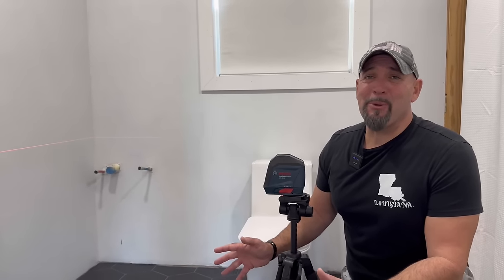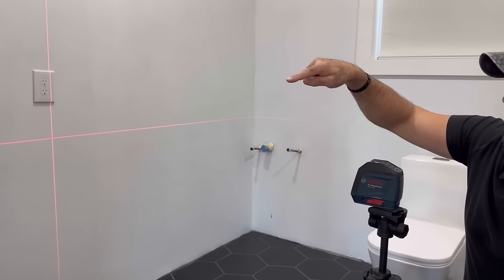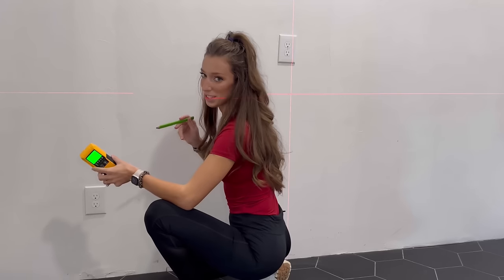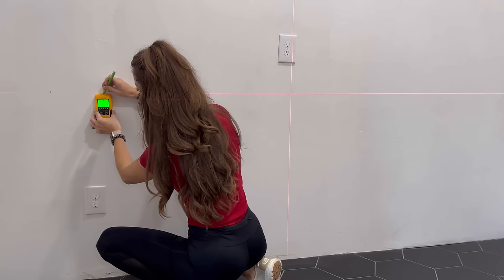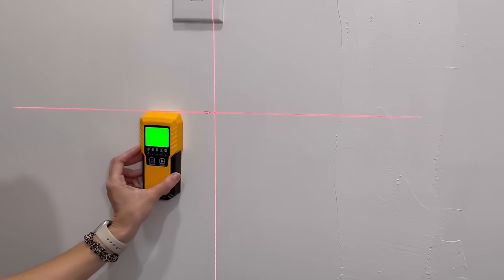Here's a really important question — how wide are we going to make the vanity? That is an excellent question and it's also a question I don't have an answer to. Just like everything else, I think we're just going to build this thing to site. We'll take the measurements as we go, see what's going to fit, and just build out from there. So what we're going to start out doing is land a two-by-four all the way across that wall, screw it into the studs to make sure it's nice and level, so we have a really bulletproof anchor point to mount this thing to the wall. While Jim's getting the saw set up, I'm going to go ahead and find all the studs so we can screw everything in and know exactly where we need to be putting this vanity. Even though it is just a vanity, we want to be able to sit on it with no weight problems, so we definitely need to be screwing this into some studs.